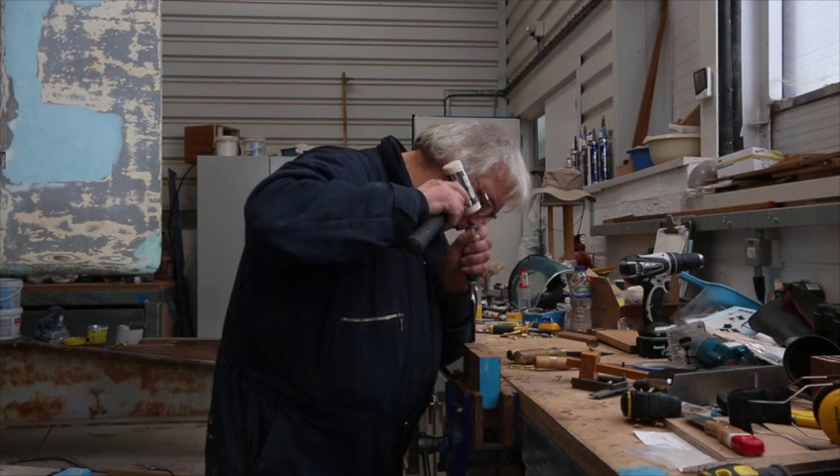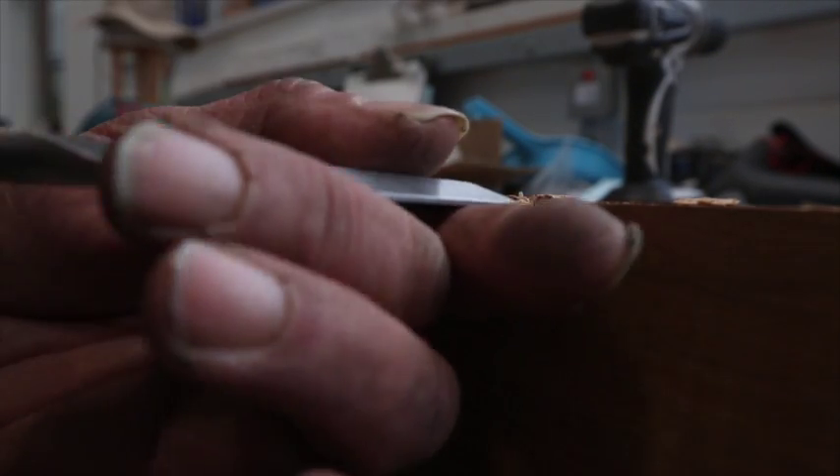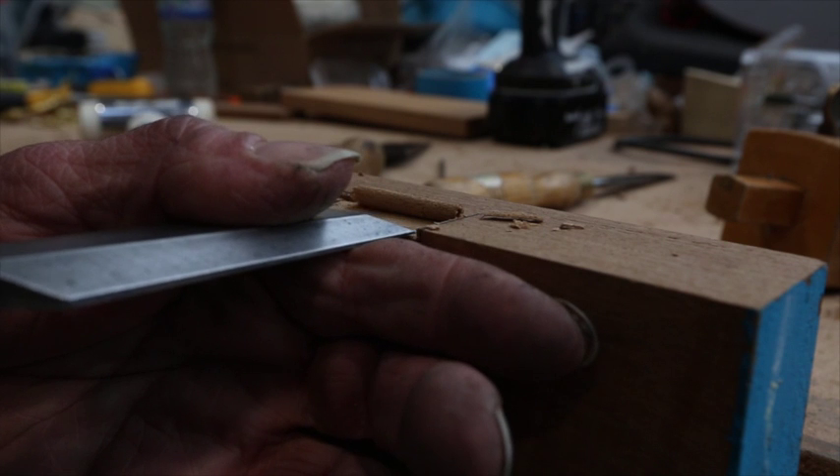The trick all the time is to be very careful and to use gentle movements, because it's all too easy to hit the chisel too hard and go down below the line, split out a bit of timber, or even worse, ruin the back edge of the recess.